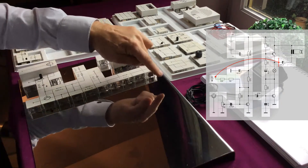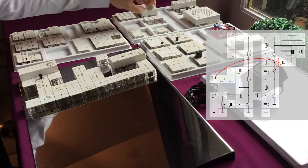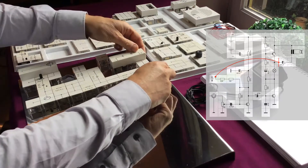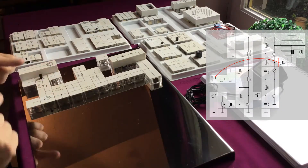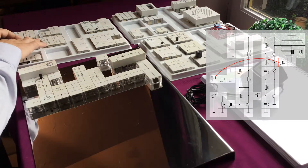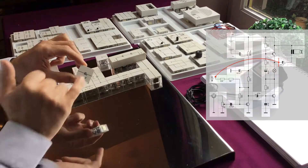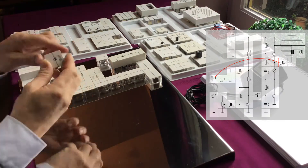Now let's move on to the next stage of our amplifier. We use a straight line block for the power supply. To separate the second amplifier from the first, we need a decoupling capacitor — we use the 10uF capacitor, and we pay attention to mount it properly with the plus facing the right way.